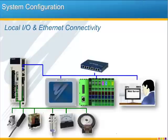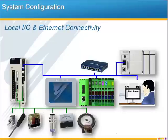On the network now, I can connect an HMI, several Ethernet I/O devices, and even a PC application using OPC protocol. We know a lot of our customers out there are comfortable with their PLC handling the network components, so this controller will often be seen just as another device reporting to the PLC. In fact, the MP2600iec can be a master and a slave at the same time over any combination of these protocols.